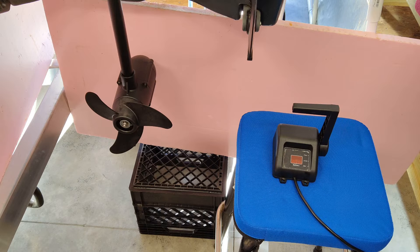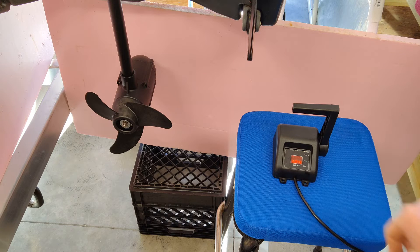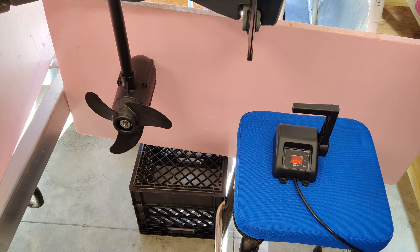I have the Haswing Pro2R 1.0 hooked up. You can see the prop on the left side of the screen, and on the right is my lever speed controller with the Haswing pot in it. I'm going to go ahead and power it up and we'll see how it goes. That's the three beeps for it being centered. I'm reading 12.4 volts on there — let's give it a go.